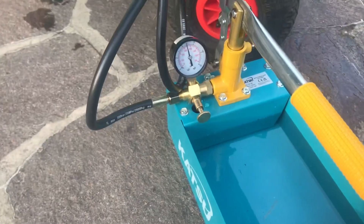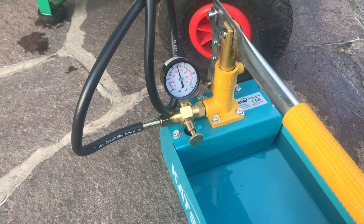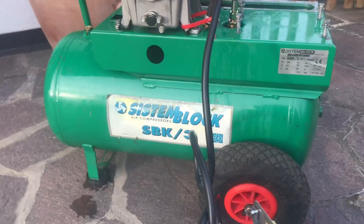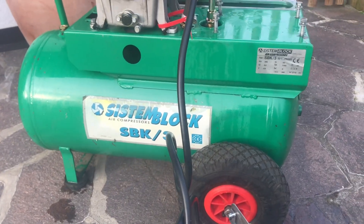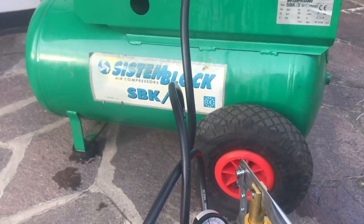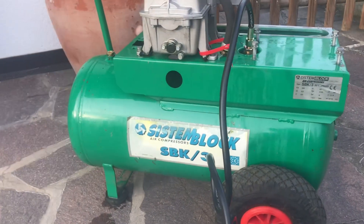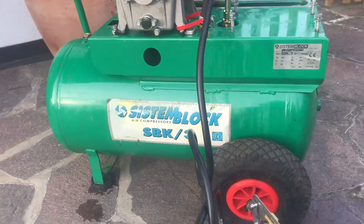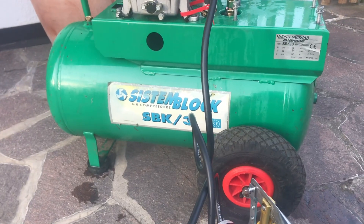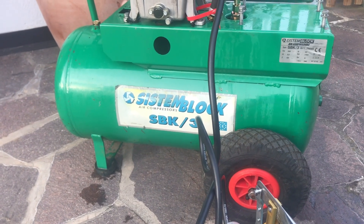Back again — that's been a good 5 or 10 minutes, well in fact more — I've been on the phone for 15 minutes, and it's still at 350 psi. So that tank, I now know, is safe. It's definitely safe to like 10 or 8 bar when it's up at like 24 bar at the moment. So she's safe to go, and it's worth it for the security. If that's under a table or underneath your workbench, you know it's safe, it's not going to blow up.